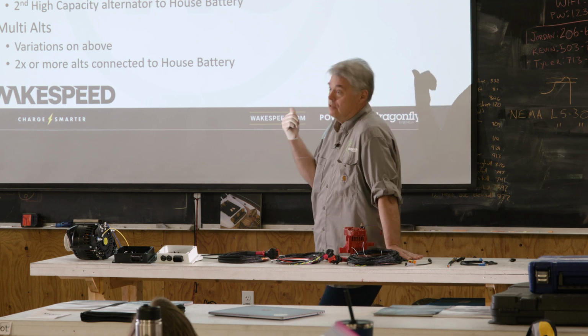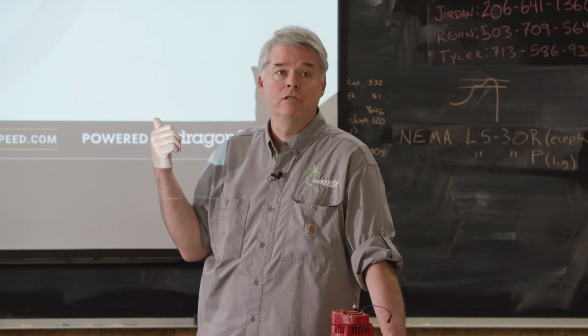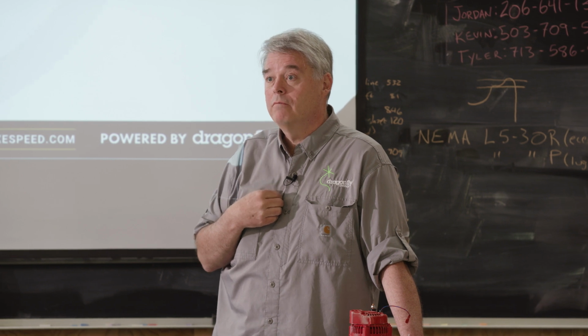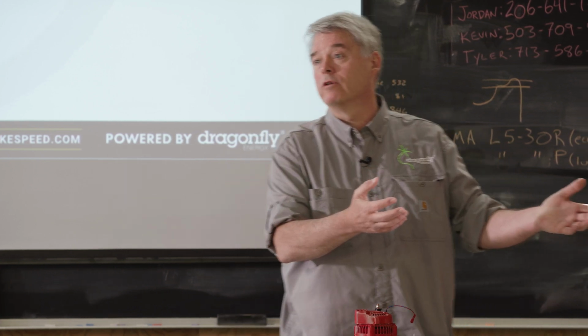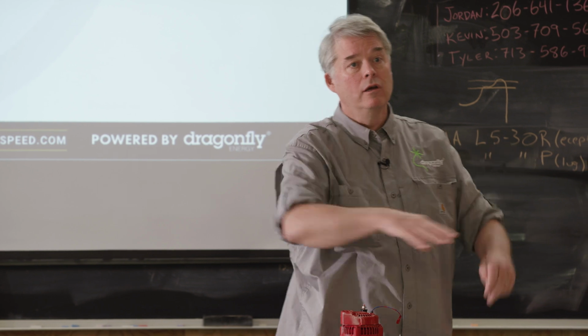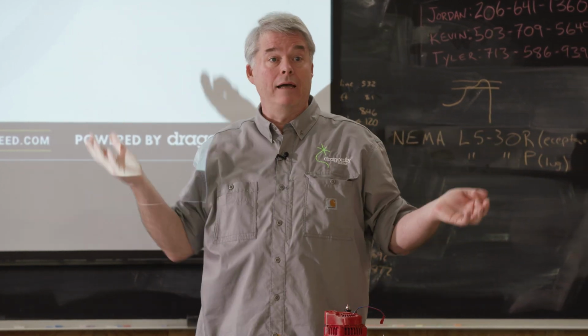You can do this with a 200 amp, 250 amp DC to DC converter. Wakespeed offered a product called the Wakespeed 3000, a 280 amp DC to DC converter. We deployed those on Ford trucks that had twin factory 280 amp alternators and a 48 volt battery. You can definitely do that, and there were reasons for doing that.